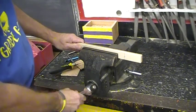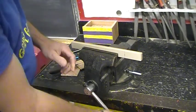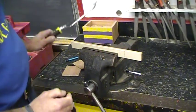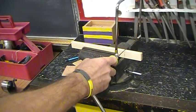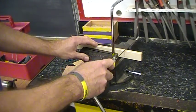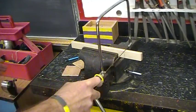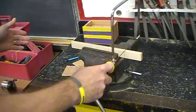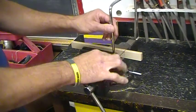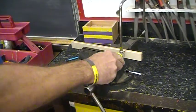You place your material into the vise and try to make sure that your cut is 90 degrees to the table, so it's straight up and down. Then you're going to place that coping saw blade right above that cut. When you cut you're not pressing down — it's just a gentle drag of the blade. Right now I'm barely holding on to the handle of the saw.